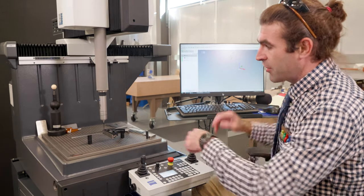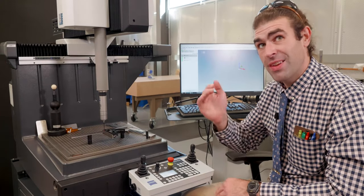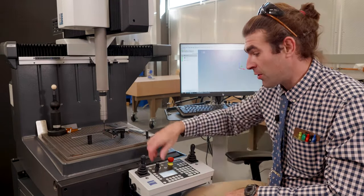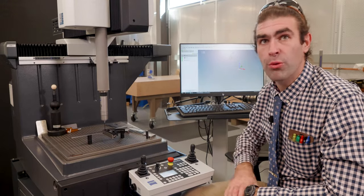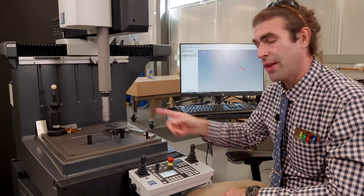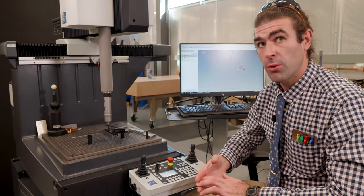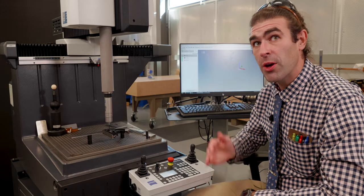We've got our base alignment. Now we'll do our clearance planes — drive around to about a half inch above the part, zoom out to see the clearance planes, and I'm happy with that. We don't need to do anything for negative Z. At this point we've got our features, alignment, and clearance planes. If you're nervous about a feature you can right-click it and hit Execute and the machine will check just that feature — it's a good way to proof your program before running it for real.